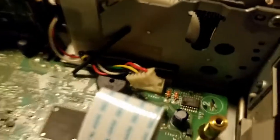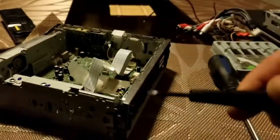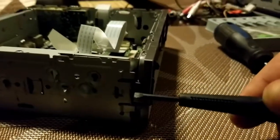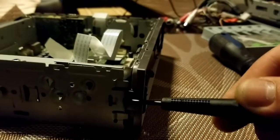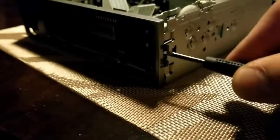All right, so after pulling this plug, I was able to get my fingernails into each side of the plug and lift up. Now the next thing you want to do is you want to get a flathead screwdriver and just pry in this section right here in the middle. Just stick it in and kind of pry out at the same time pulling on the face, and you'll do the same thing on the other side. Just pry in this middle area